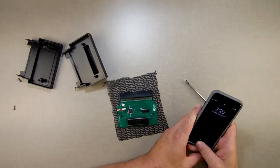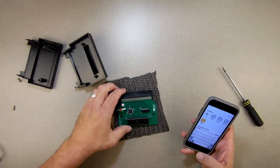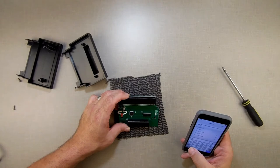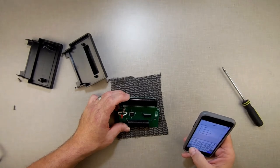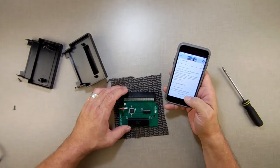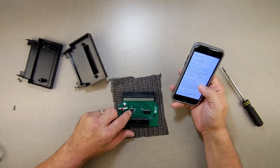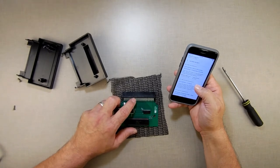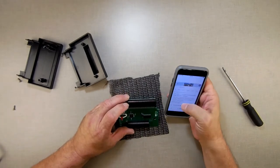Let's get out the old phone and let's just look these numbers up on the Google and see what it is. So this first one, again, take off the glasses so I can read, is an ATF1502AS. And that is a complex programmable, it's a CPLD. So I would assume this is the part that's handling the decoding of the various input output lines to access the sound chip. And probably also to access the RAM. Now, I'm assuming this is going to be the RAM, so let's just see.